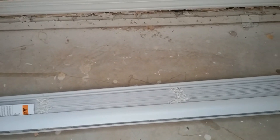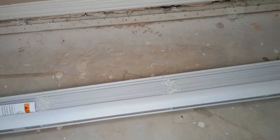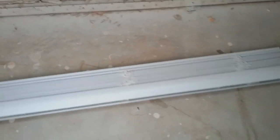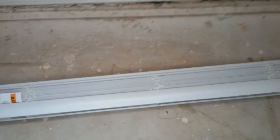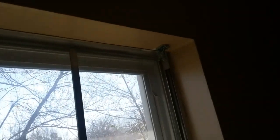I may have to trim this one, but I'm still going to put them in there even if I have to trim it. Okay, got the brackets in. One thing you want to make sure — stand back and check that they're square. If they're not square, you're going to have a real tough time clipping your blind in there. If I wanted to go back more I'd have plenty of adjustment right there.